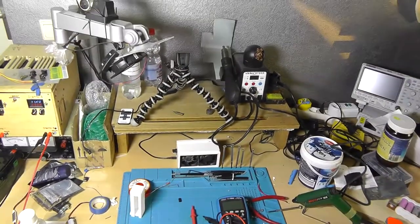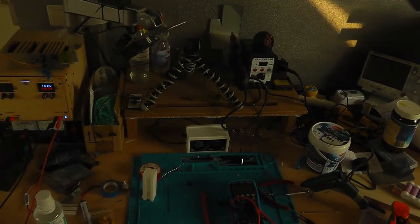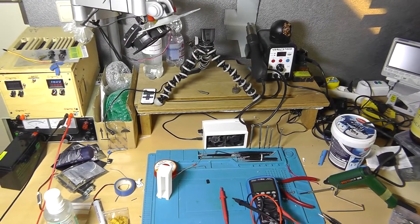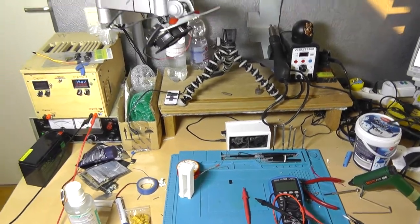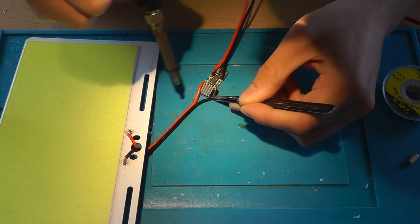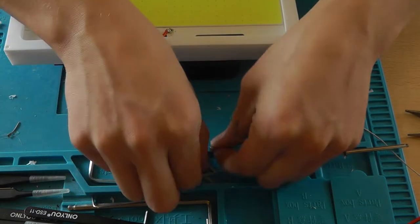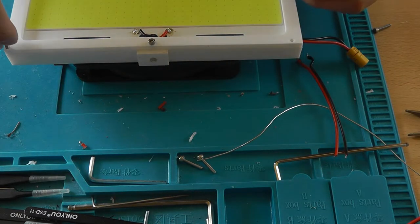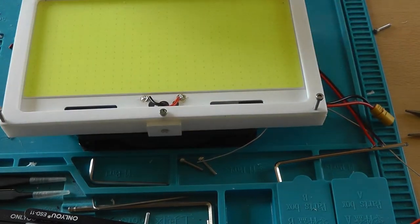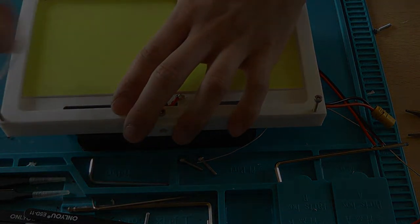What you do want to order are tiny heat sinks that you want to put on the MOSFETs themselves. Now, I'll also put a link in the description for the heatsinks, as they are heatsinks for some kind of stepper motor driver and not for the MOSFETs, so you can order those heatsinks yourself. You'll also need a DC to DC buck converter, it may also be a buck boost, and a 140 by 140 millimeter 12 volt computer fan in order to blow air over the heatsink and cool the LED and the MOSFETs.